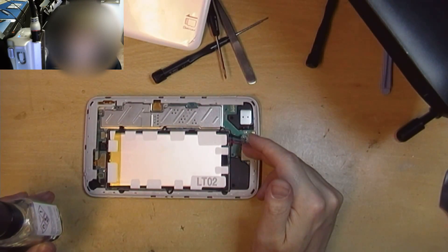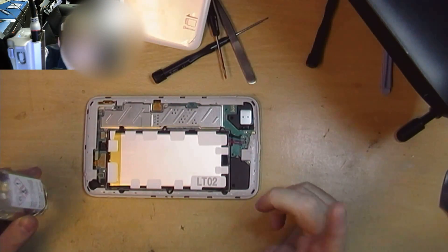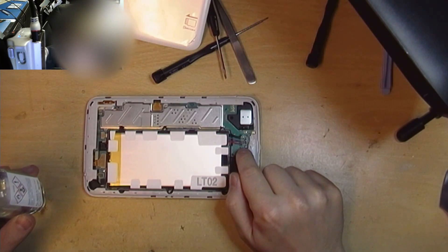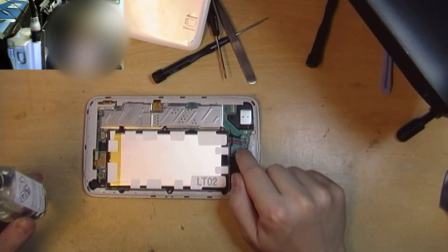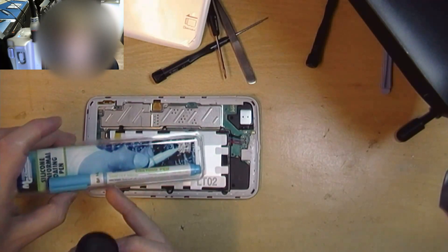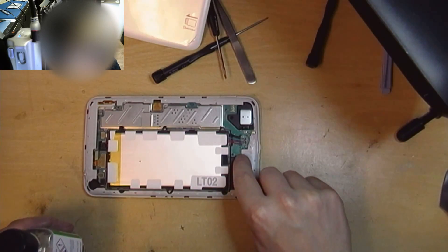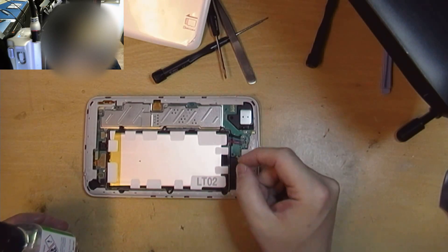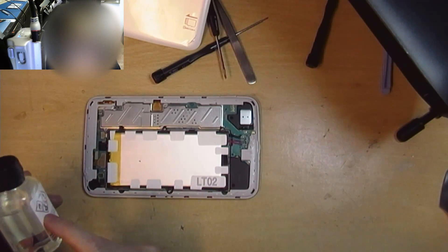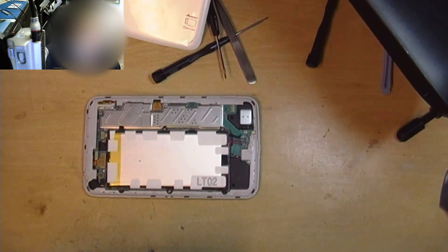So that's what we're going to do. Let's just turn that fan off. We are going to have another fan going in a couple of seconds, because this stuff really does smell when you open it up. I do have a conformal coating pen here — the pen is a little bit better for small scale work, say if we were changing a capacitor. But because it's thicker wires, I'm going to be using the brush because it can get all around the wire.